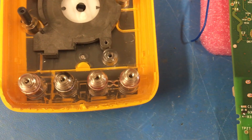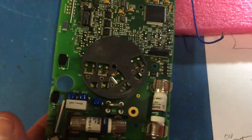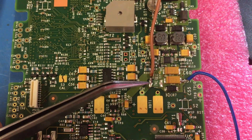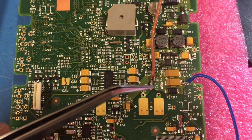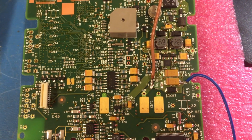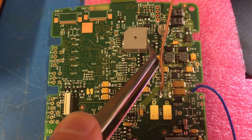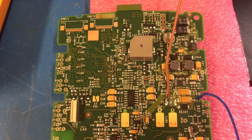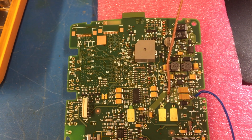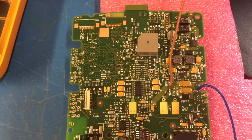If you want to power the meter up without batteries, you can connect a couple of leads to these two points: put the positive 9V DC supply on the left-hand side of the poly fuse, and tack on to the end of this tant capacitor for the negative return — you don't need anything else connected. I disconnected the sounder by desoldering it so the buzzing didn't drive me mad during early investigation — don't forget to solder it back when you're done. I'll put the part numbers in the description; hopefully that should fix your problem. Thanks.